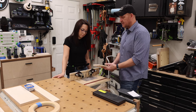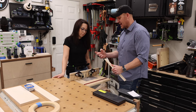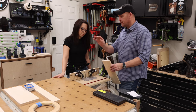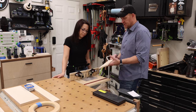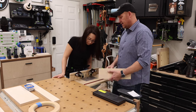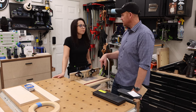We're basically splitting the thickness of the board, because this is 12-millimeter ply — also referred to as half inch, even though it's not a true half inch. Splitting it in half makes the math for doing the panels super easy. The fence is currently set so we have to make this in two passes because this bit is only three-eighths of an inch wide — not wide enough to do the entire thing at once.